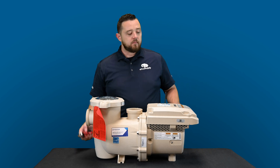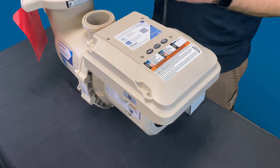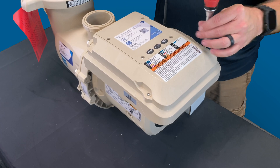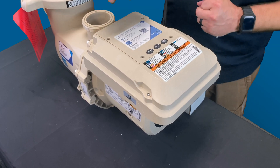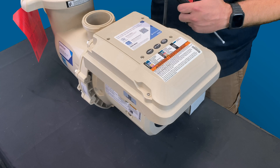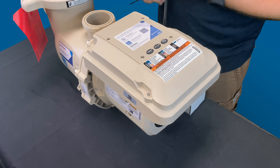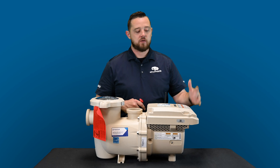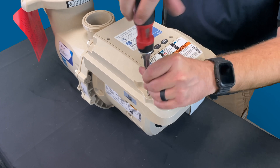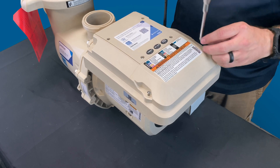You're going to focus on the two Phillips head screws located on the back end of the pump. Go ahead and use a screwdriver and just loosen those. Only these two screws — if you're focused on the four screws on top, you're going to pull that board off and there's not really much underneath it. I don't suggest doing it; it was very difficult to get back on. When you're looking for the power hookup and the installation of the I.O. board, focus on these back two screws. Go ahead and completely remove them. Don't use power tools — just a regular screwdriver. Last thing you want to do is break this expensive pump by over-tightening anything.